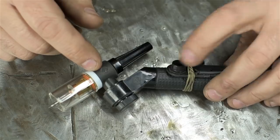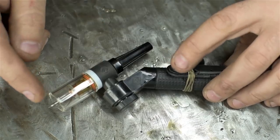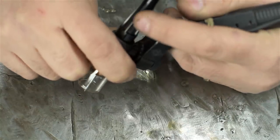Like if you're clicking up or down on a button or trying to scroll a track wheel, it tends to get my tungsten bobbing. As it is, I already have no trouble doing that on my own and don't need another thing to add to that. Though with the TIG button, I've taken to holding it in the crook of my finger.